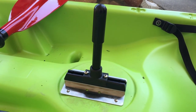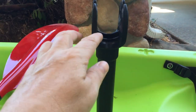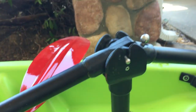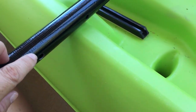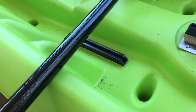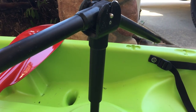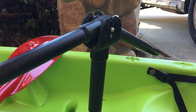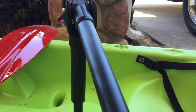With the track and post in place, you're ready to get out on the water. Simply slide our clevis onto the post — it's got a V shape. You put the Angle Oar in and it snaps in place in the angled position. There is a push pin that can lock into one of three holes in each shaft, so you can lengthen each shaft depending on the size of your kayak. If you have a wide sit-on-top, use a longer position; if it's narrow, use a shorter position. If it's windy, you might lengthen one shaft and shorten the other. Experiment a little, but you can see it's a nice, easy rotational movement.